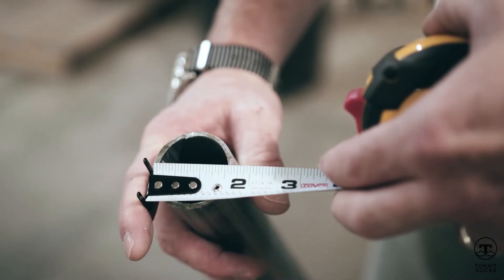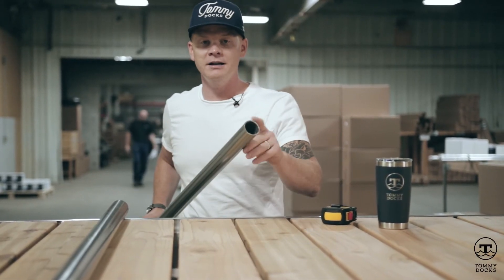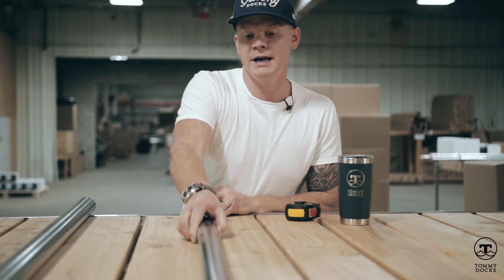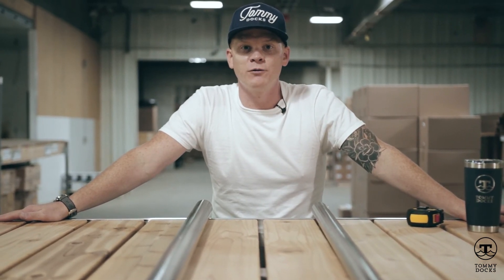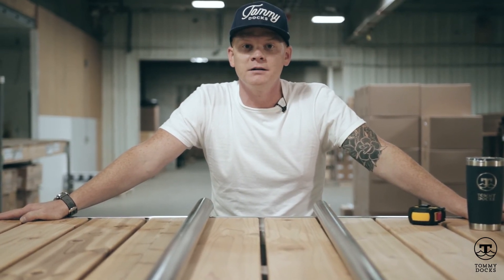Over here on the normal duty, this is inch-and-a-quarter pipe — the physical outside dimension is 1.66 inches. Again, double galvanized and also G238, so the tensile strength is the same. As always, be sure to subscribe for updates, news, and tips to improve your DIY lakeside lifestyle. Thank you!